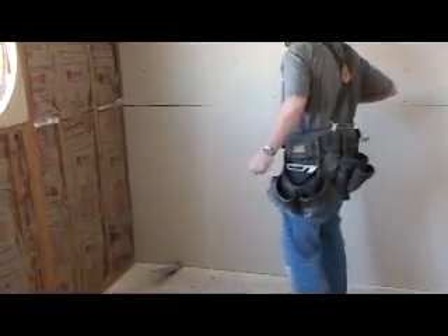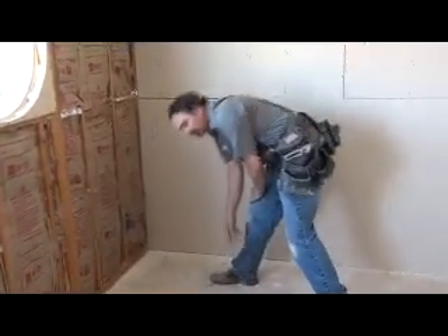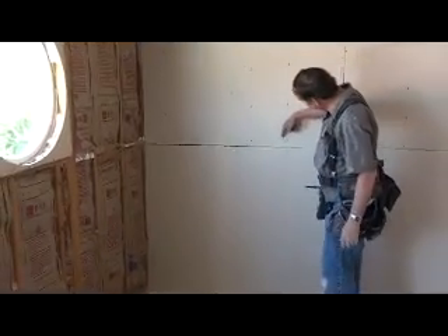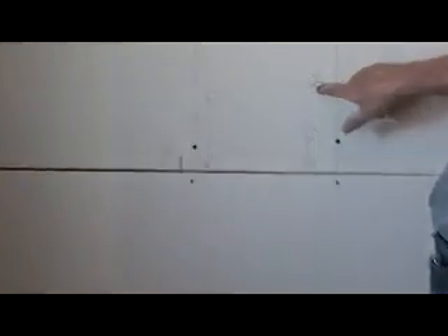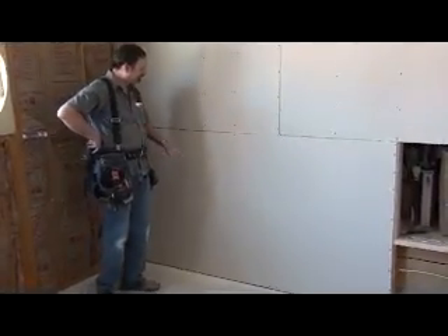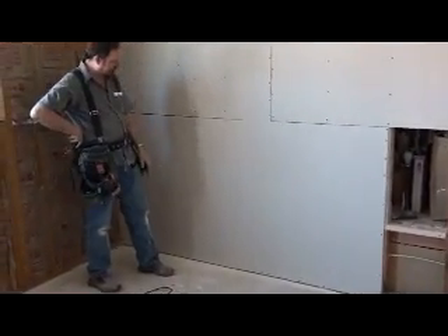On this wall there were some electrical boxes which I haven't even cut out yet, but I did mark it down here. You've got an arrow, four and a quarter inches, 33 inches for another box. Here's one at 33 inches. Now I've got these electrical boxes - I've already marked them down here, and those are the tops of the boxes.